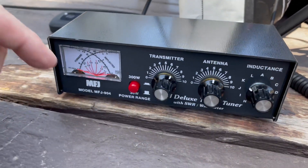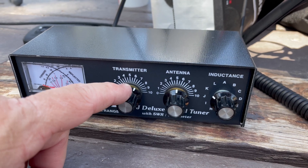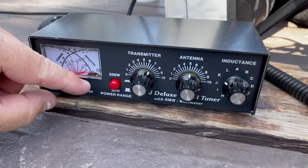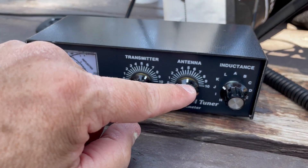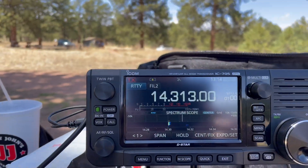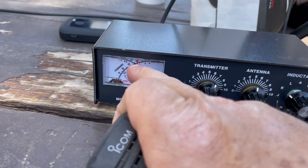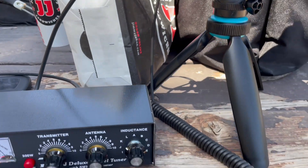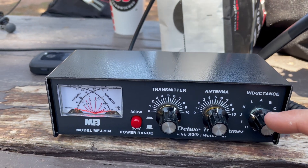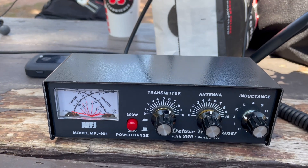I was clicking and I got a reflective power of five, so that's where I started. Your transmitter dial starts on five, your antenna dial starts on zero. You keep keying and slowly increasing your transmitter dial to get the lowest SWR while raising the antenna dial to get your full wattage out. I'm on the 20-meter band — SWR is zero, total power output is at 100%, which is 10 watts. I'm at SWR 1-to-1 at 10 watts, moving the transmitter dial from five to about seven and the antenna dial from zero to about five.